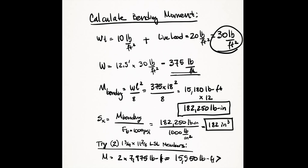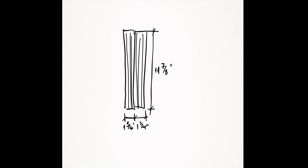The LSL solution will look a lot smaller than the two 4x14 solid lumber solution, so let's go with that engineered lumber solution. Note that the width of the two 1-3/4-inch members totals 3.5 inches, which fits perfectly in a two-by-four wall — which is actually 3.5 inches thick — if you're planning on covering up the beam with drywall afterwards.